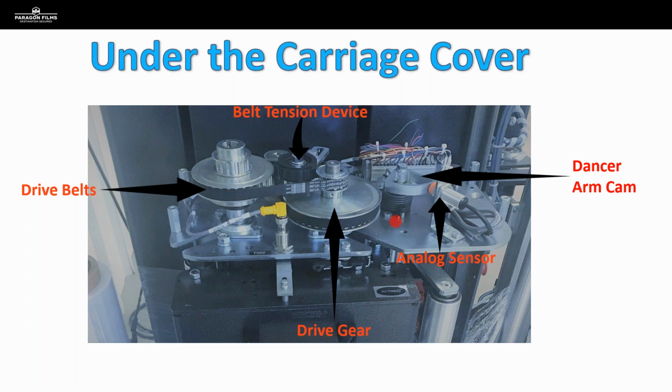So that's something really important for you to know and important to internalize, because you will come across customers that want to talk about pre-stretch and turning up the pre-stretch setting on their machine, and unless they've got one of those select types of equipment that can actually do that because it's got those servo motors, there's no way for them to change their pre-stretch unless you actually have your service tech come in and change out those gears.